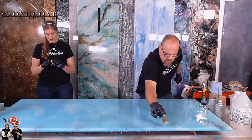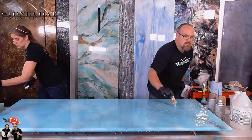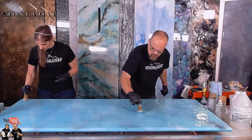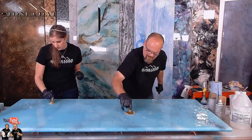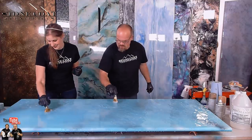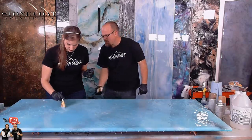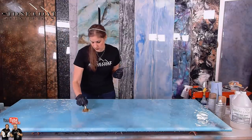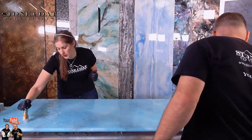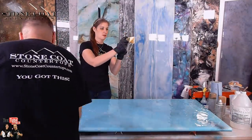Man, the way this is set — this is going to look really good. We'll show that before we sign off. Now we're going to turn this beat-up workbench into a fancy desk. You definitely don't want to go in lines — you want to do a random chopping pattern. By chopping, we actually want you to use the back heel of the brush and just go up and down in a random pattern.